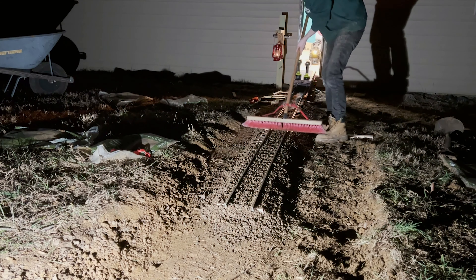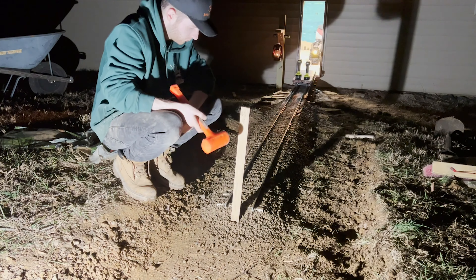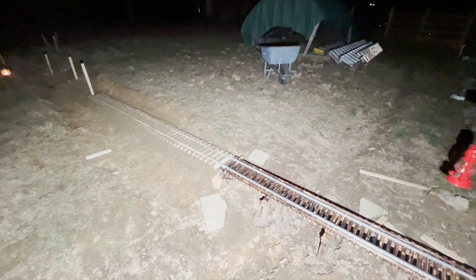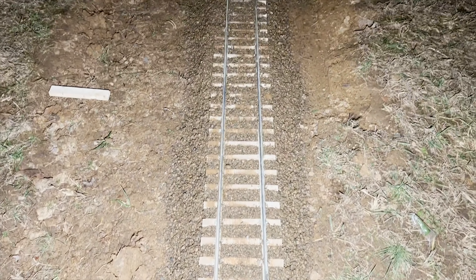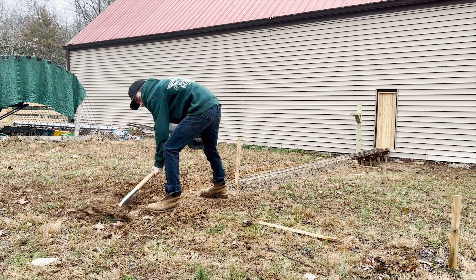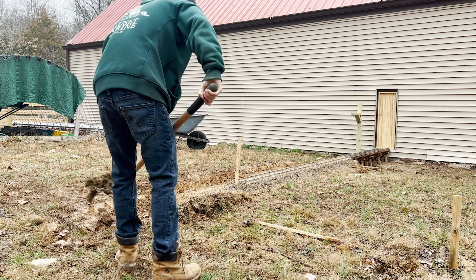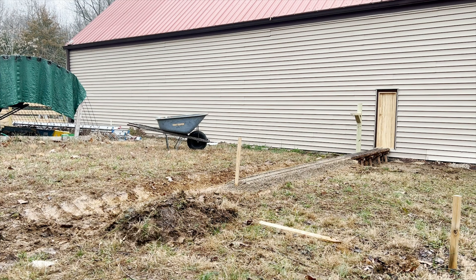I will admit I had to add a bunch more ballast through this first section than I thought, and this will actually all be re-tamped the following morning. Live and learn — I'll raise the dirt pack about another inch for the following track sections. All that mattered for this first evening was making sure that 311 could get outside for some fresh air on our new shop spur, which we did successfully accomplish. There's something incredibly satisfying about doing all the grading, leveling, and tamping by hand. I think it was Ollie Johnston who once said bringing in machines to make the cut would take all the fun out of it. I may feel differently as I get further into the hillside, but I am thoroughly enjoying the process and the manual labor for now.